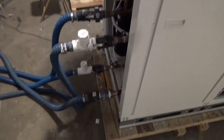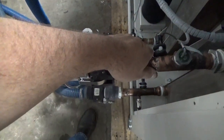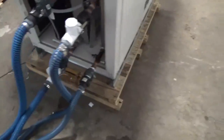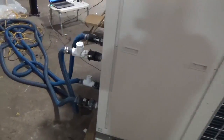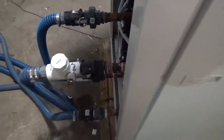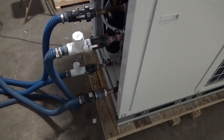Out of the side of this unit you're going to see some hoses — we're actually running it right now. It is producing hot water and chilled water. The hot water is the closest one and the chilled water is the second one. The most amazing thing is it's doing this simultaneously, taking 100% of the waste heat produced to make air conditioning and putting it into the hot water side. The condenser and condenser fan are not even running at this time.